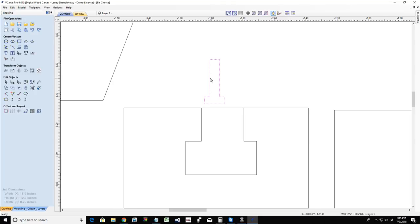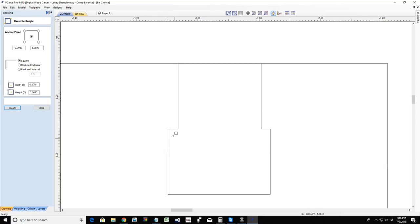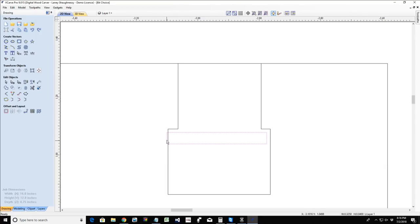And when I came to cut to that depth, whatever it may be, I needed to do multiple passes. So it ended up creating a shallow T-track. And as I ran that cut in 1, 2, 3 passes, it was able to cut and make that T-track for me, giving me enough lip that would hold my T-bolts, my nuts, all of that stuff from being able to pull out or slip out. It still got that same effect.